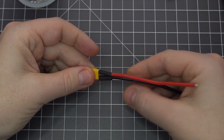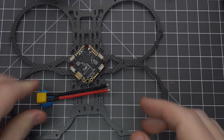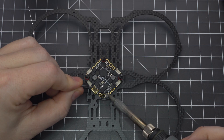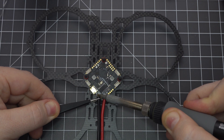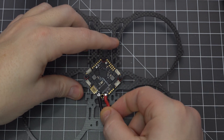As always, it's easiest to solder the wires to the plug before you solder them to the board. I trimmed about 2cm from the wires to save a little weight, but that's entirely optional. And rather than use the holes, I soldered over them to create pads. Finally, make sure the solder penetrates all the strands to make a solid connection to the board.